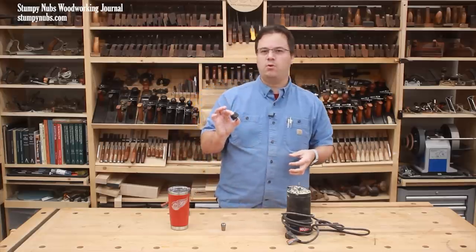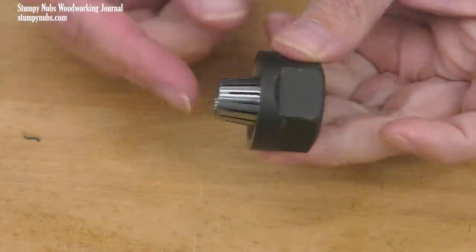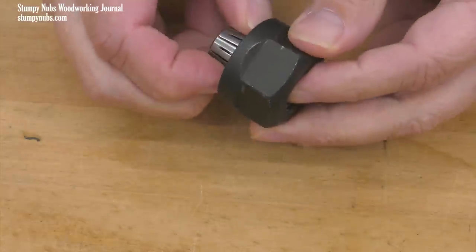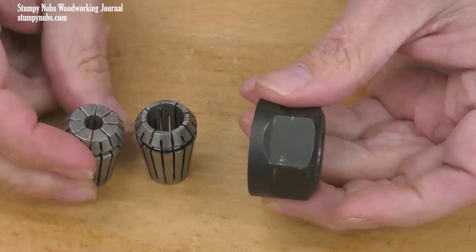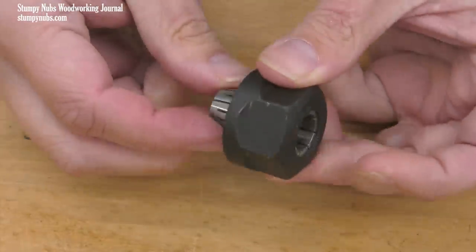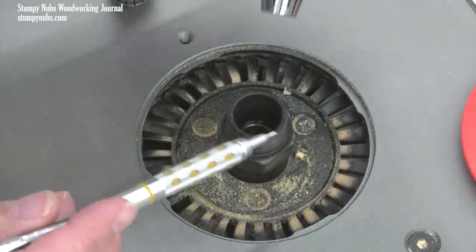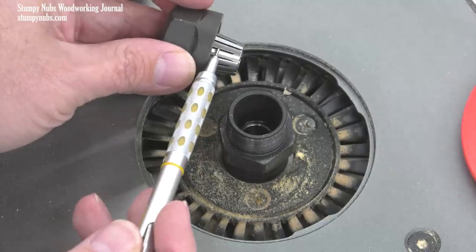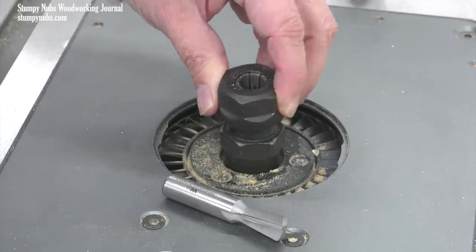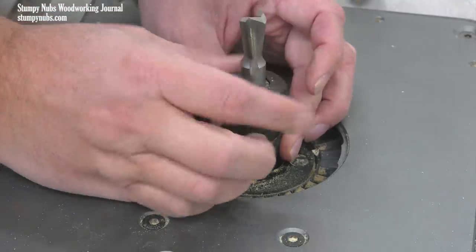These are very common on Porter Cable or other similar routers and they look something like this. The collet is the inner sleeve, which is attached to the nut so the two can act as a single assembly. You can snap the collet out and replace it with a different one, perhaps switching from quarter inch to half inch, but the two remain locked together during use. Now the base of the collet slips inside the hole on the end of the router shaft. Note how the hole is tapered to match the sloping sides of the collet, and note the slits in the sides which allow it to compress. As the nut is twisted onto the threads, the collet is drawn deeper into the hole, which begins to squeeze it onto the shaft of your router bit, locking it in place.